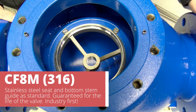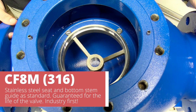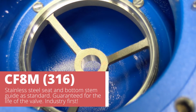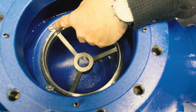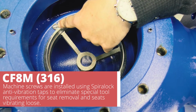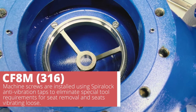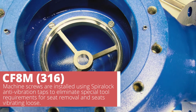What you're looking at now is the inside of the body, and the seat that is in there is 3/16 stainless. It is a hard stainless, and because it's such a good high quality stainless steel seat, Singer gives a lifetime warranty. The seat is held in place by machine screws. These are put into a spiral lock tapping, which is anti-vibration. There's no possibility of them coming undone when the valve is in operation. In fact, you should almost never have to take this seat out.